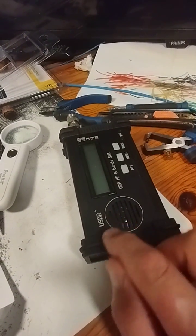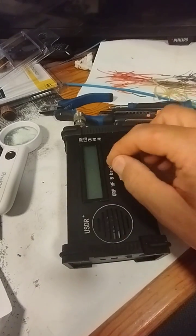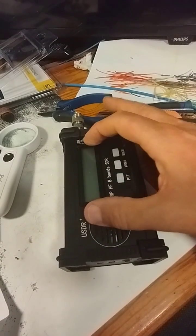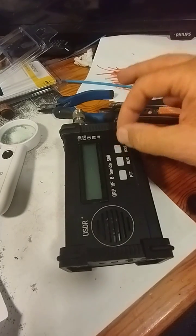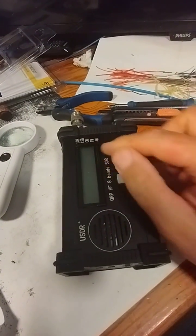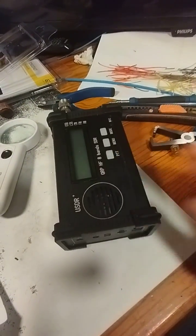Make sure you've disconnected the speaker cable first — that's the very easy way to get to the programming. Then you've got to take off the two nuts for the LCD, and there's a little board here which also has to come off. Then you'll see the programming connector, and you can leave these two boards off whilst programming — and that's it.